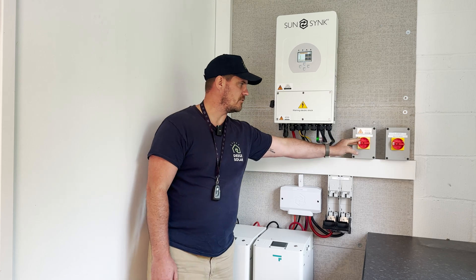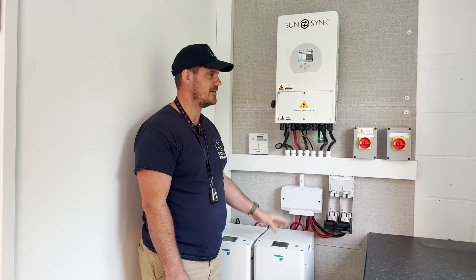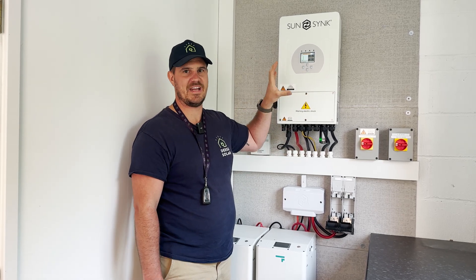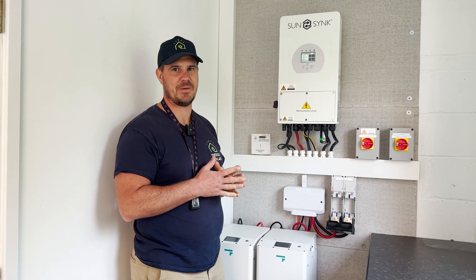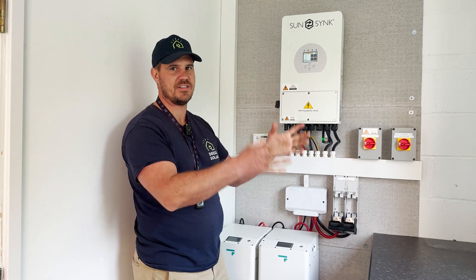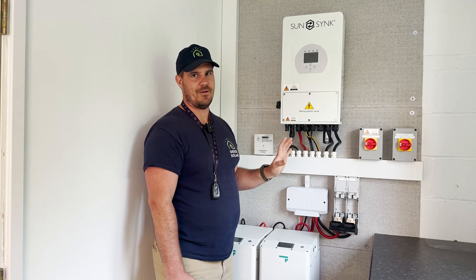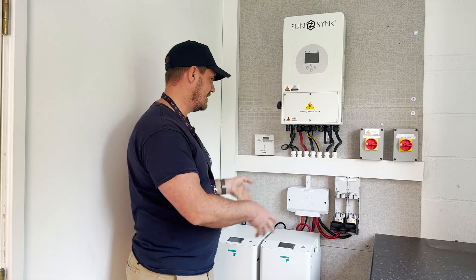So now we've turned off the grid, we've turned off the on and off button, we've turned off the batteries, and then we've turned off the PV. Now we've turned everything off. So why is this display still on? Because there's still energy inside the network. Voltage in the DC network takes a bit longer to exit, so we're going to wait for it to wind down for the voltage to leave the network. When it does, this will go completely blank. And there you go — so everything is now off. There's no energy in the network, no energy in the system. The inverter is fully isolated.